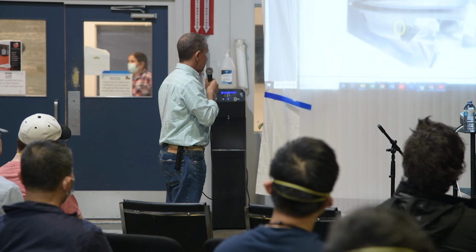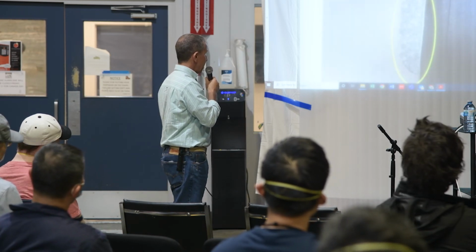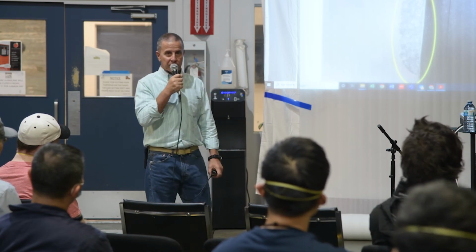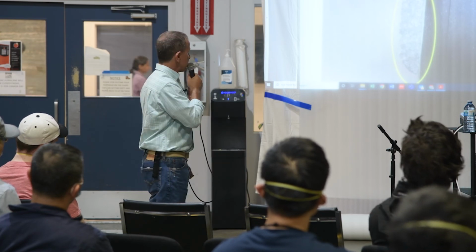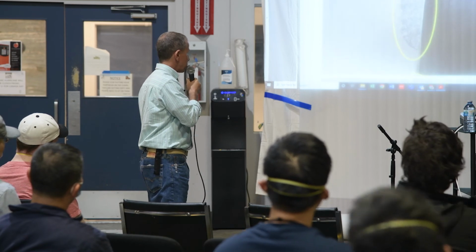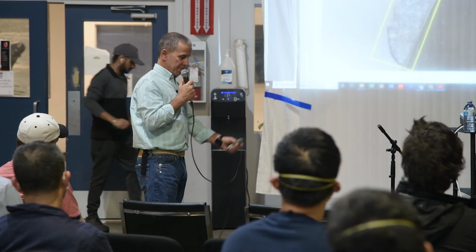I don't know what's going on here. Yeah, that's not your fault, really. That's the engine manufacturer. So that paint is being damaged at the interface between those two components, and then poultice corrosion is working its way under the paint. I don't know how you would avoid that. That's an engine manufacturer issue, really, not you. I'll consult for them later.